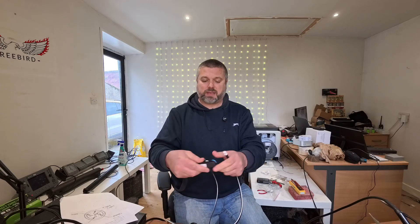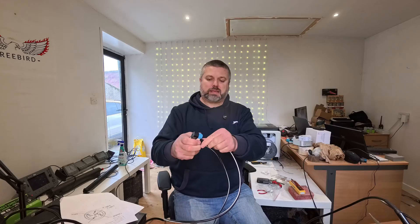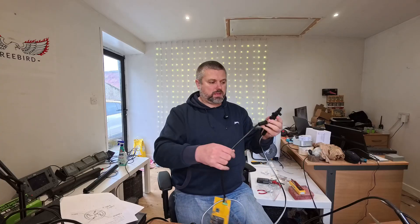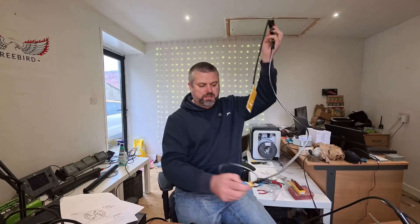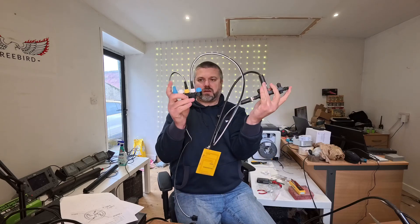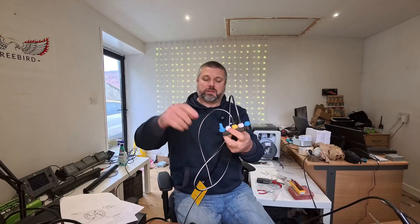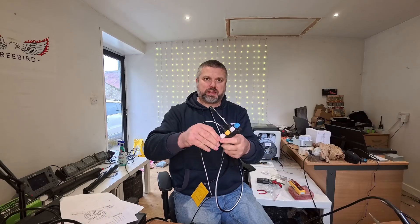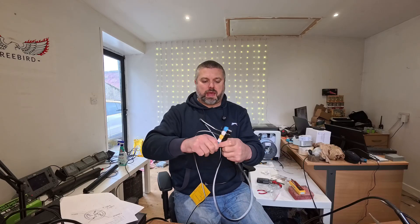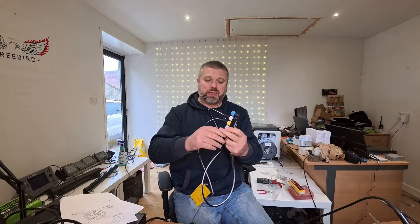What I imagine I can do is put it in here and that will just work the same — the wiring's all the same anyway, it's just high and low. So what we can do is we've got the resistor on one end, we just put the resistor on the other. As long as you've got the resistor on either end of the bus, that works. I can then take this resistor off and put it onto my main SeaTalk NG on the test bench.